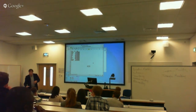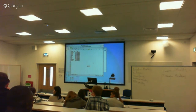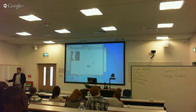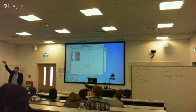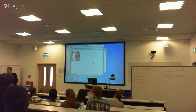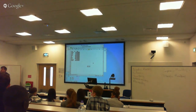Now you should be able to answer this question. How do you harden steel? What's the process? Absolutely. Heat it above the critical temperature, then quench it, cool it fast. You've seen it, right? What happens with steel when you heat it to a high temperature? Does it go liquid? You don't heat it enough to melt it. No way. If you melt it, it goes all over the place. No, it's still solid. But you heat it to a temperature at which what happens? This is the key word.